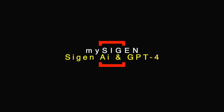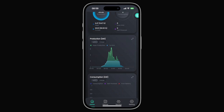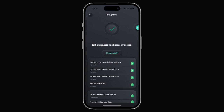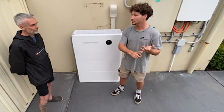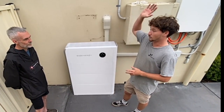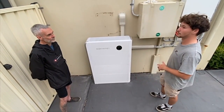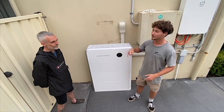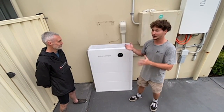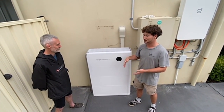One of the things I really liked — you can click on the inverter tab, there's a little side arrow and it brings up all of the stats feeding into that inverter: battery percentage, battery voltage, and string PV voltage and current per string. We tested it all before plugging in, but strings from the roof were feeding two different inverters. We removed both of those inverters and extended the PV strings to get into the SIG Energy. Right now we're actually running completely off the grid — solar is charging the batteries, and the batteries and solar are supplying the house loads.